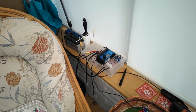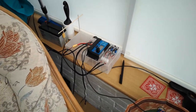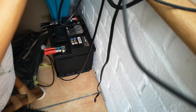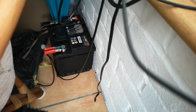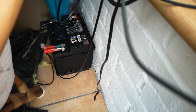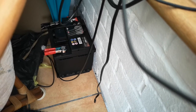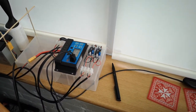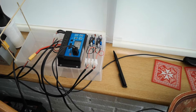If you disagree with me and want to give me a spiel of technical information, just put that in the comments. Honestly, in terms of a battery like this — it's lead acid, right? Lead acid is pretty much the same regardless of whether it's a car battery or deep cycle, mostly. The actual physical construction inside is different, I am well aware of that. Car batteries are meant for short, sharp bursts of really high current for your starter motor — I get that. But if you're just sipping very small amounts of power, those lights through the boost converters probably draw less than half an amp — maybe about 300 milliamps in total.